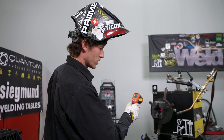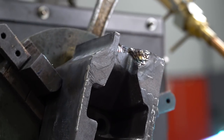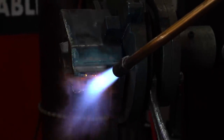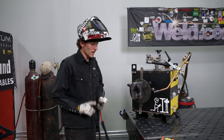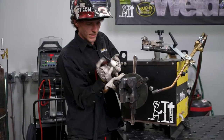We're coming down to 290-300 degrees, so we'll go ahead and get the torch back on it. Got to keep the heat in this thing — 350 to 370 degrees. Putting some more wire in here; it's a bit hot so I'm going to use my other gloves to rest my hand.